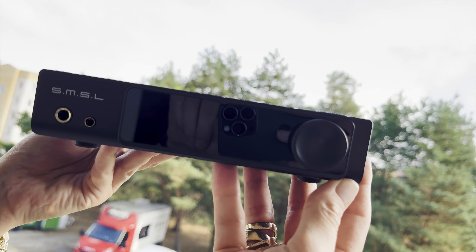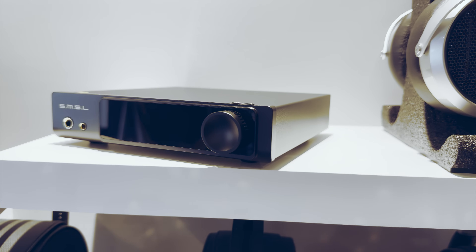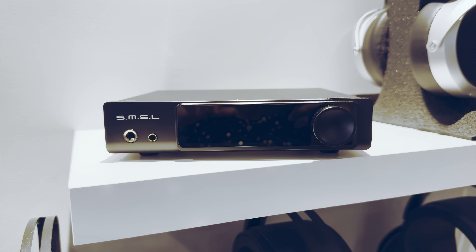These amplitude levels suggest high gain for the DAC section, so driving external amplifiers will be easier as gain shouldn't be much of a problem, but you have to be careful about clipping the signal with some amps. Higher voltage outputs from the XLRs will provide greater dynamic range and headroom. The headphone output delivers 2.5W per channel for 16 ohms and 1.7W per channel for standard 32-ohm loads. For PCM it supports a maximum of 768 kHz at 32-bit, and for DSD, DSD512 is the limit.